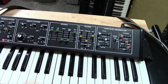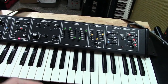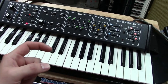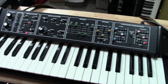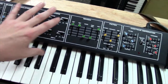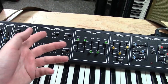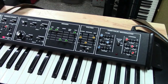What it has from the Realistic is the polyphonic section, expanded with more dividers for more octaves. You also get ring modulation from the MG1 — they use a phase lock loop chip which has a VCO in it to drive the top octave synthesizer chip for the polyphonic section. Inside that phase lock loop is an exclusive OR logic gate, and they feed the two oscillators into it to get ring modulation. The layout looks like a Rogue, but the oscillators look like a Realistic, with more variety than single flip toggles.